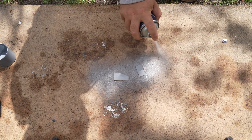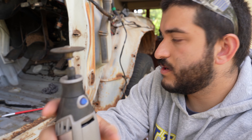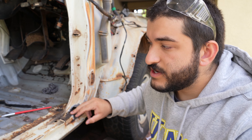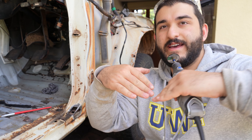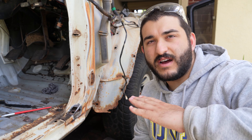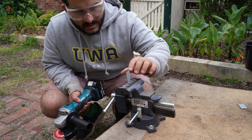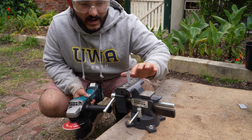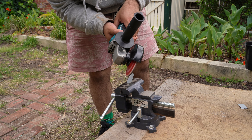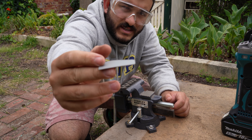While we wait for them to dry, let's just prep our work area so we're ready to weld. I've got a grinding disc on the Dremel and I'm just going to lightly touch all of our edges to create a sort of V in. That should let the weld sit nice and tight just on top of that V and hold pretty strong. Then we can do the same thing to our pieces — just lightly touch the edge and create a bit of a V.